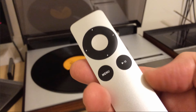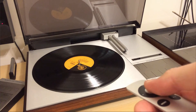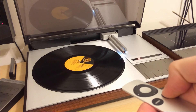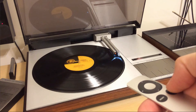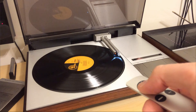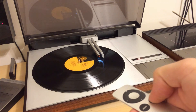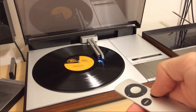Let's see it in action. We start out with the 33 RPM function for wiping the platter, and now start. And cueing forward — cueing is dynamic, so if the finger stays on there for a couple of seconds the tone arm accelerates. The start button also allows to lower the tone arm again.